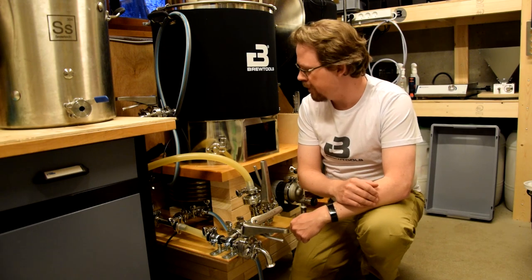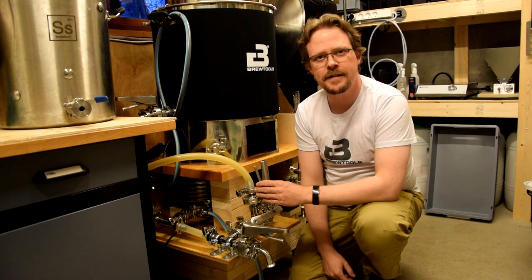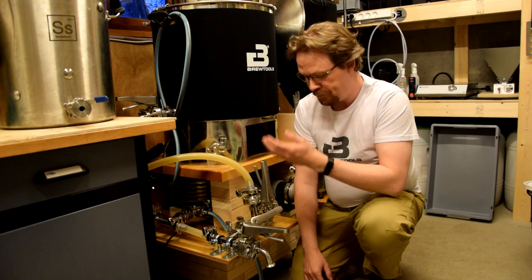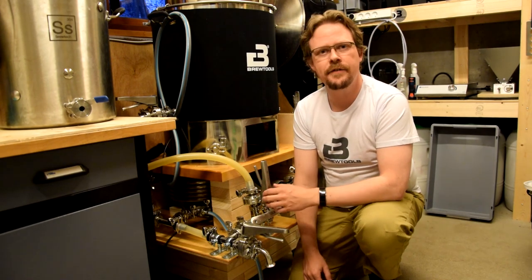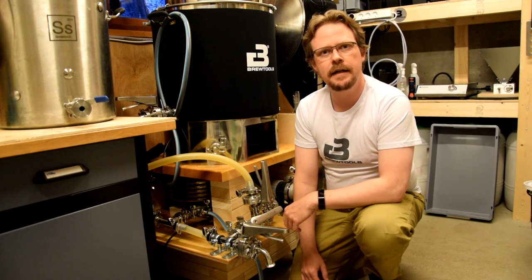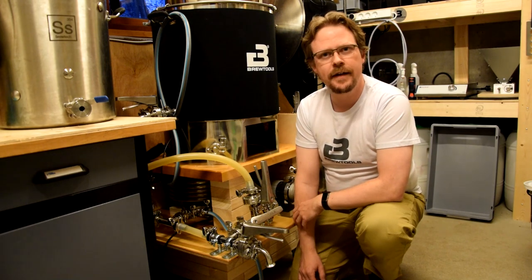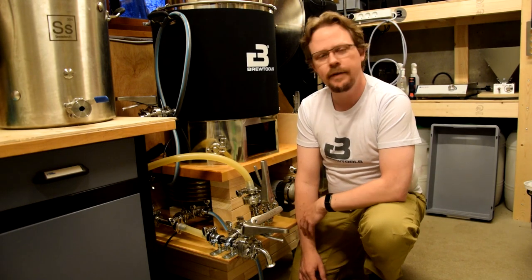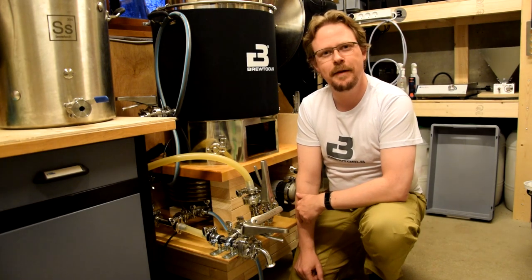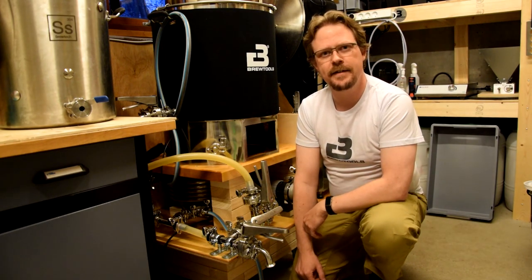I'd like to use this video to explain a little bit what I have done to my Brewtools system, my B80, in order to make it easier for me to clean. I have changed all the ball valves for butterfly valves available from Brewtools in a 34mm. So I will take you through the various valves and how they work and why they're here. I hope you enjoy, and if you have any questions, let me know and I'll try my best to answer them or take some pictures showing it from other angles if that's necessary.